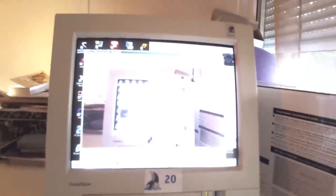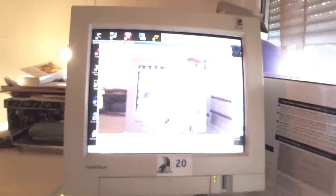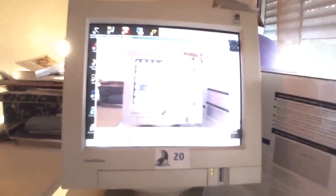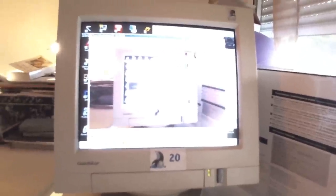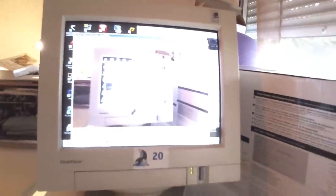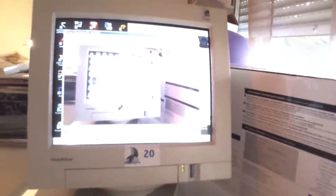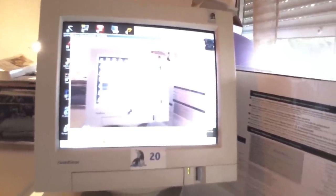Another thing is that this CRT PC monitor has a shadow mask, which delivers phosphors with the shape of little circles, which is not the case of my TV. My TV is a Trinitron, and Trinitron is a technology with not a shadow mask but an aperture grill, which delivers phosphors of a different shape. So one must remember that the phosphor, when comparing the TV and this CRT PC monitor, will not have the same aspect. And that's also a pity because my previous 21-inch monitor was a Trinitron.